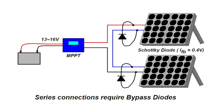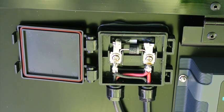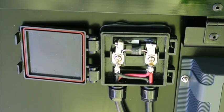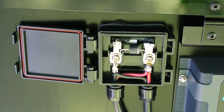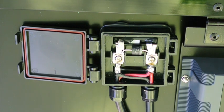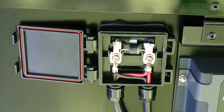If we connect solar panels in series we need to use bypass diodes. Fortunately many solar panels already come with bypass diodes built in, as we saw when looking at the wiring block of the suitcase solar panel — so in many cases you don't have to do anything. When panels are wired in parallel the built-in bypass diodes are simply dormant. Some people snip the diodes out based on claims they caused a fire, but I think that is more of an internet myth. If you ever use those panels in series you can actually damage them by not having the bypass diodes in place.